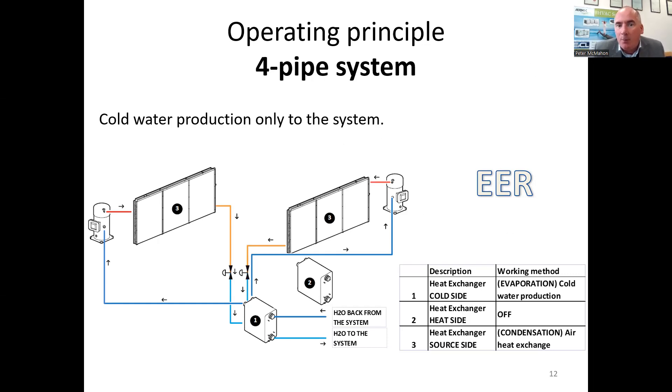The difference with a multi-functional heat pump is you can have cooling only, heating only without a cooling load, or simultaneous heating and cooling. This is a very basic schematic of a refrigerant circuit with two circuits and a compressor on each. You pump high-pressure, high-temperature gas through the condenser down to the expansion valve into the evaporator. In this cooling-only mode, heat exchanger number two — the recuperator — is not being used, and both circuits are dedicated just to cooling.